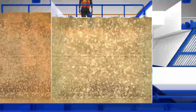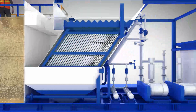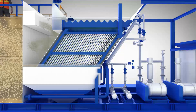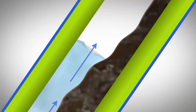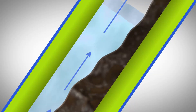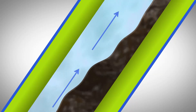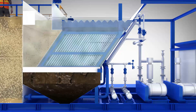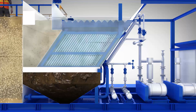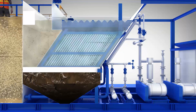At this point, BOD has been significantly reduced. Only removal of biomass and other suspended solids remains. The lamella uses Stokes Law to operate, meaning that biomass is settled and removed as waste sludge due to being heavier than water. This equipment also features a specially designed plate pack to improve solid removal efficiency, with water recovery of greater than 99%. The sludge collects at the tank's conical bottom and is removed periodically.